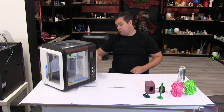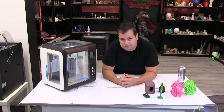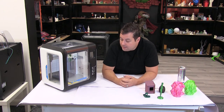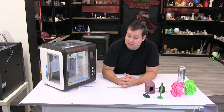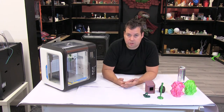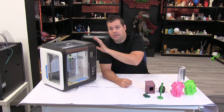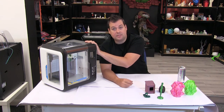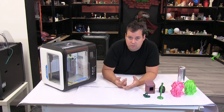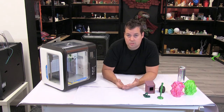It's Wi-Fi enabled as well, so you can use their cloud-based software. You're still using Flashprint for this, although because it's not got a webcam or dual extruders and things like that, you can output in a GX format from Simplify3D and from Cura. It just takes a little bit more tweaking to get those profiles right. If you were putting this into a maker space, I would absolutely say to everyone: use the stock profiles on Flashprint and they will get genuinely, repeatably good results.